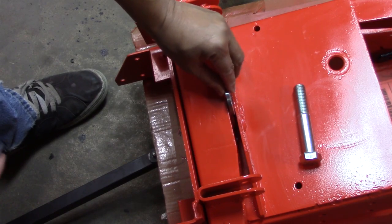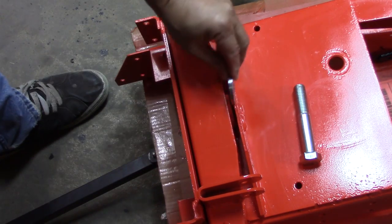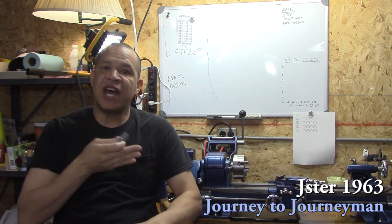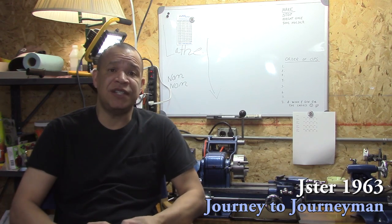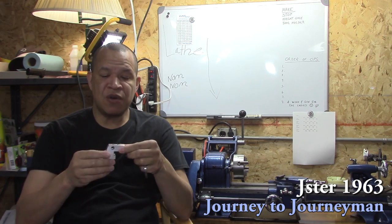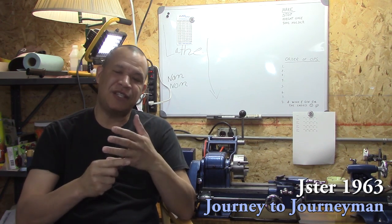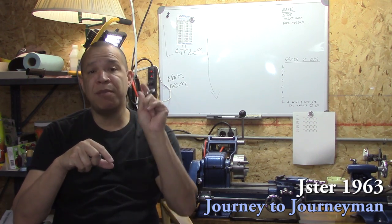This is the thrust washer that I made, and this is the one I bought. This one fits; this one's a little too thick. A couple of quick lessons learned: number one, anytime you're messing around on your machine tools and just playing around, you learn stuff — so it's not bad to just go turn some metal. Also, when you're doing your engineering, if you take just a little forethought in it, you could save small errors. And lastly, until your eyeballs are totally calibrated, you may want to measure before you make scrap metal.